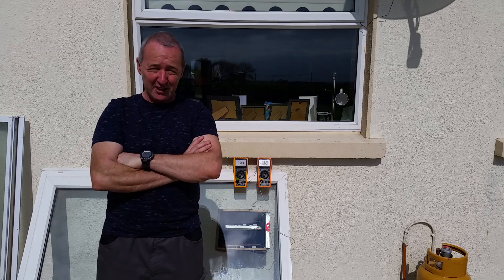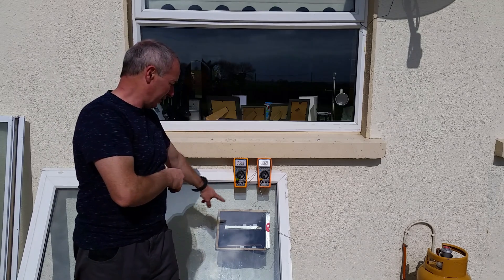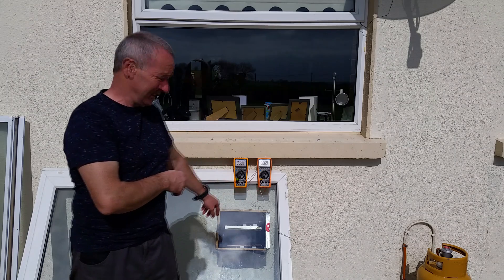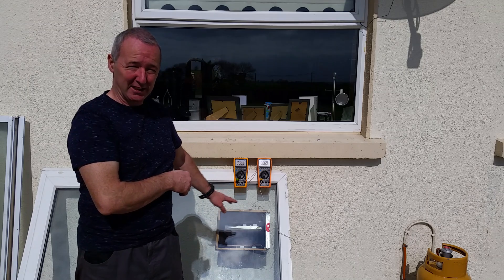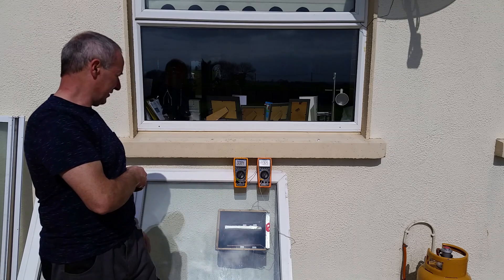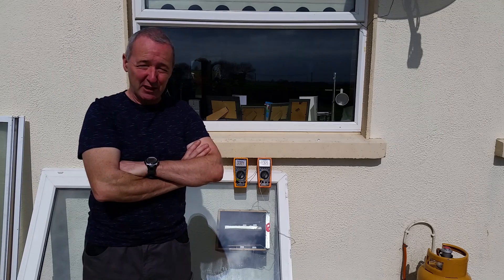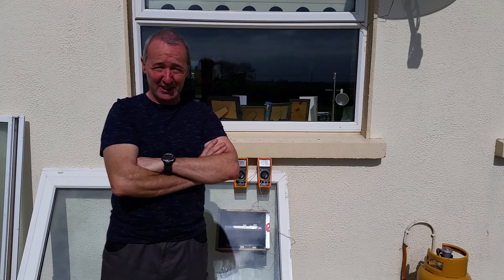That's your update with regard to the solar. It's actually gone up to 83 degrees now on the top pipe. It's not significant where the pipes are placed — what is significant is the fact that the top pipe is black, flat black, and it's made an awful lot of a difference: 14 to 15 degrees difference in centigrade, which is a lot. But 84 — that's fantastic.